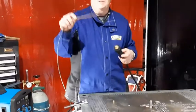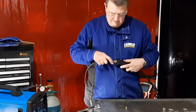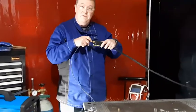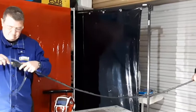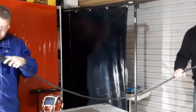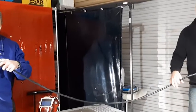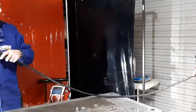At Signal we sell these as kits. So we push that down there — you've got to feed it in very carefully and you've got to have your friend on the end keeping that gun very straight. You don't want to bend this nylon liner — if you bend it, that's your $30 or $40 down the bin. There it is coming through now.